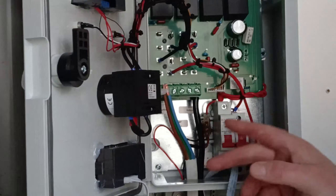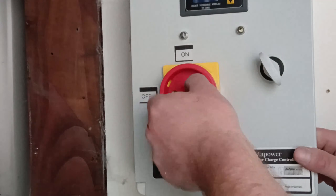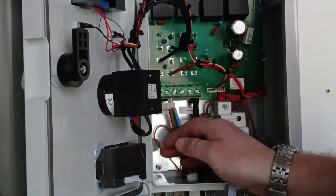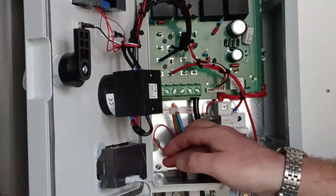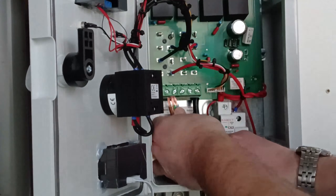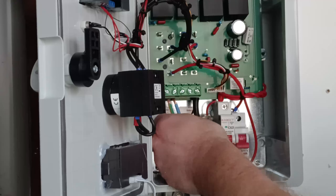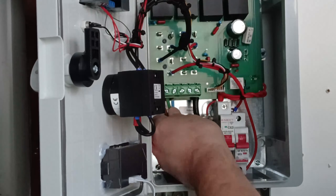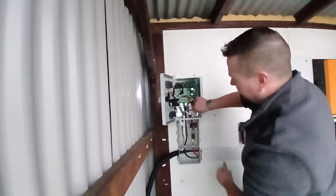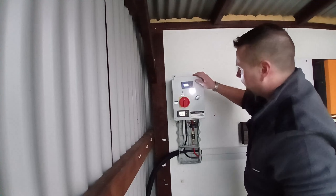So here is the tricky bit. The wind is blowing out there and I have to get the three phases of the turbine connected before it spins up too fast. So first thing — put on the brake. Cut the cable tie and quickly get them in there: one, two, three, shove them in. Now with everything in place there's only one thing left to do — switch on. We have a light! We are reading 52.4 volts.